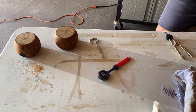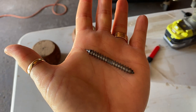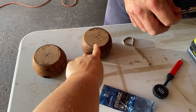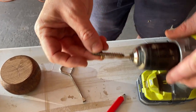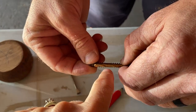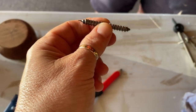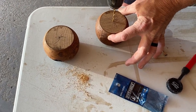Matt is back with what we needed — they're called dowel screws. Different places call them different things; at Menards they call them dowel screws. To figure out which bit you need, you line it up — the threads should be showing, not the middle. He wants the bit to be a little smaller than what he's putting in so it fits tightly. He found the center on the bun feet repurposed from the table legs and he's just going to pre-drill that hole.